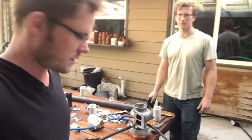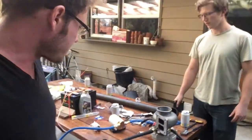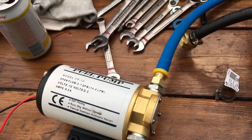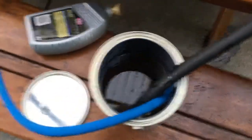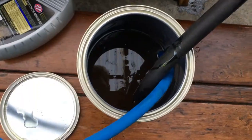What we learned was that the pump stalls because it wants to run a higher volumetric flow through the whole thing than we can possibly achieve, and it gets really hot and wants to burn itself out. What we're gonna do is add a little T right here with a valve coming off the T section that's just gonna recirculate back into the reservoir, so we can find the right pressure where the pump isn't overloaded and is happily running, but there's also oil coming out of the turbo.